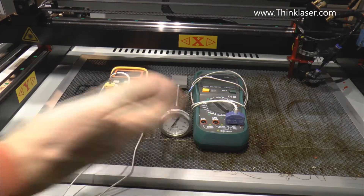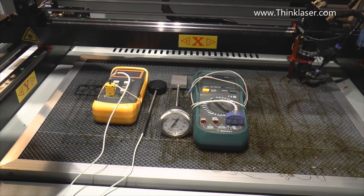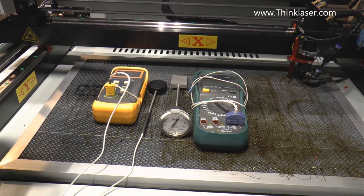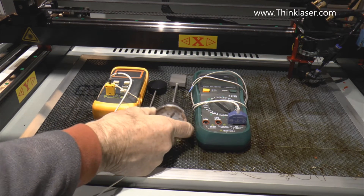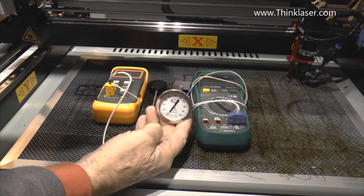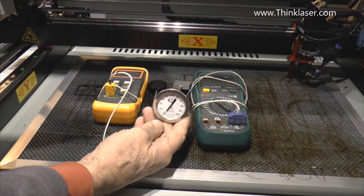I'm going to be using two pieces of equipment but I've got three here just to show you. To establish how much power the laser is generating and how much is arriving at and from each mirror, you need an instrument that measures heat. There are many different types of power measurement meter on the market - some very expensive and quite accurate, others cheap. This is a power meter costing around $250-$300 from an American manufacturer and it's very good quality. You can buy a Chinese copy for about $100 which is adequate for the job.